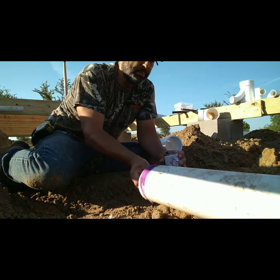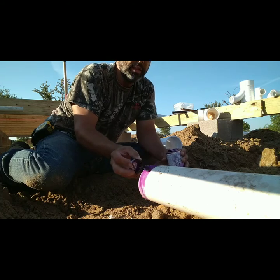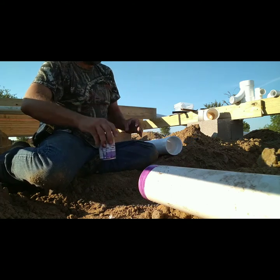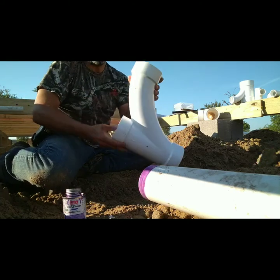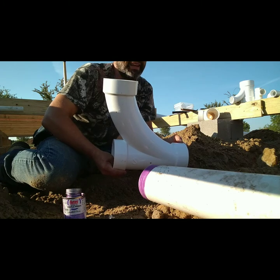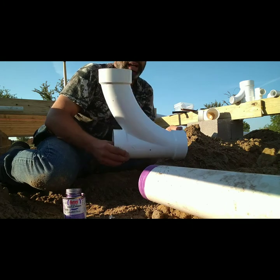When I'm gluing pipe, I use a lot of primer — especially on this pipe here because it's something I've had. These joints are about $20 a piece, a dollar a foot, 20 feet long. Another thing I'd like to talk about is this right here — a sweeping tee. I only use inch and a half, two inch, and four inch. I use four inch for my main line. It might cost a little extra, but I don't want to unstop the pipe.